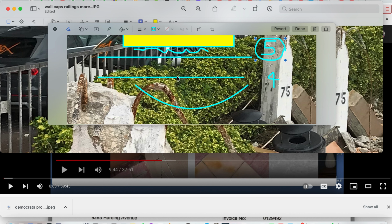So what happens when we see deflection? When we see the fractures underneath in the parking garage area, you've already bent your strong back, and you've also bent your number 4, but you've got some weird behaviors going on here. If you want to dive down there and look at research on this, there are many studies that did beams, putting the stronger steel at the top and the lower steel at the bottom, and look at the fracture behaviors. But do not just look at it with the narrative. If it says you're looking at a shear fracture, please disregard that. Go at it with open, virgin eyes and just look at the fractures as they develop.